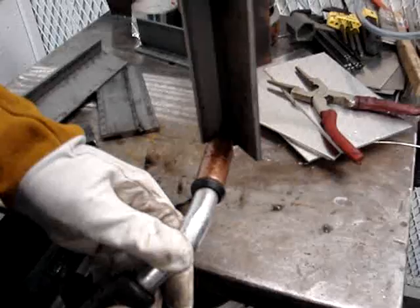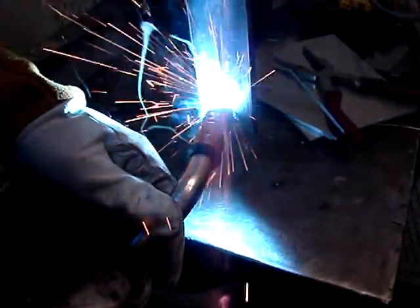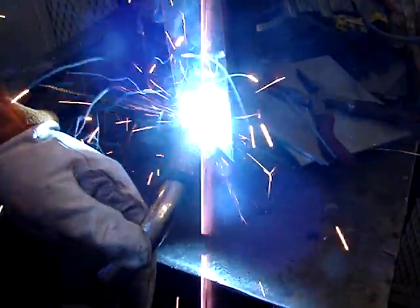So anyway, I'm going to compare that upside-down V to a triangle-type technique today. We're gonna slice and dice — we're gonna do T-joints and lap joints, and now that I have a better camera I'm gonna give some arc shots. The upside-down V technique basically has you tracing the front of the puddle in an upside-down V shape, because that's the shape of the puddle if you're getting all the way into that corner, which you need to do on a T-joint.